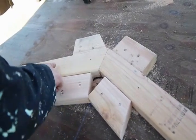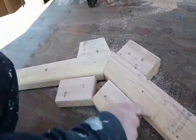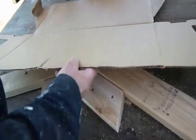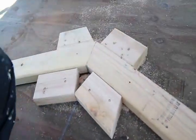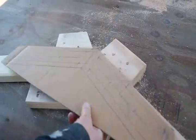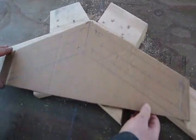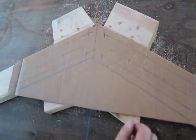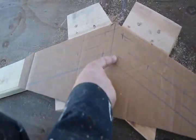Because I need eleven, I found the most efficient way to lay out and cut them is to use an old piece of cardboard for a template. Recall from my earlier video that the gussets need to be at least 24 inches wide to give you enough strength and nailing power. Note how the sides and bottom are straight cuts — this provides a much stronger gusset and it's a lot easier to cut.